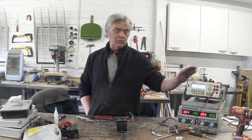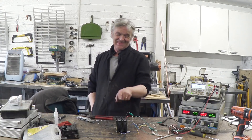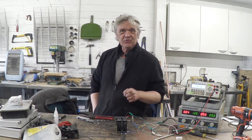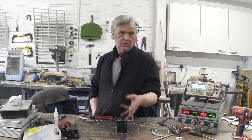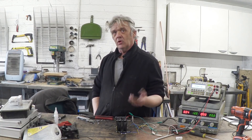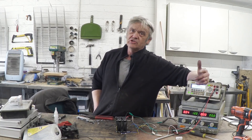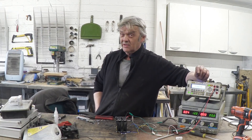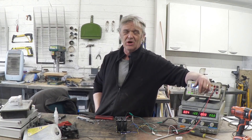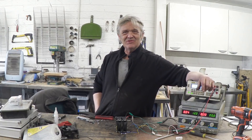And that cost me nothing. Even if you wanted something more powerful — and it will work to the rating of the motor, whatever the motor rating was is what it's going to work to — if you have to buy a more powerful, more expensive motor, you're probably looking at a couple of hundred pounds. But solid-state inverters are thousands of pounds. So we can make a mechanical inverter that is really quite efficient, can handle the power, and does an awesome job of converting DC into AC very cheaply indeed. I hope you found it interesting — thank you very much for watching.